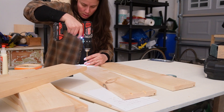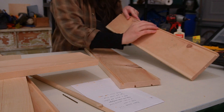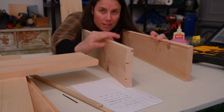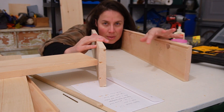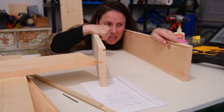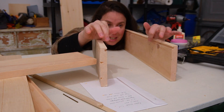The most important thing in putting this together is to make sure that these grooves line up, because otherwise it'll be hard to insert the MDF. But the other thing is that these boards are bowed — the wood that I used was bowed. So I'm kind of trying to make do with the bend in them. I'm just trying to make the best of it. You really need to make sure that the grooves are all lined up — if nothing else is lined up, make sure the grooves are lined up so that the MDF, when we slide it in, it'll just slide in.